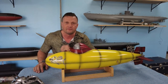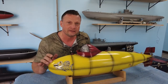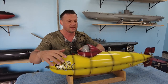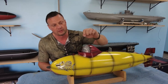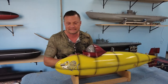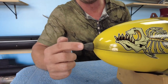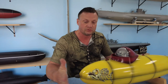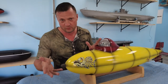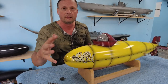Let's walk through this boat front to back and share with you what we've got. This is a fiberglass hull that we manufactured here at the Dry Docks — an epoxy hull top and bottom with a 3D printed shell on the top and a little acrylic dome where the operator would sit. On the very front you can see a little nipple there, and this is actually a soft rubber cone. The real boat had one of these as well, but we've cast it in rubber so that if you do impact something you've got a little bit of shock absorbency. This also performs double duty because you can unscrew it — that is how the upper and lower hull is held together.